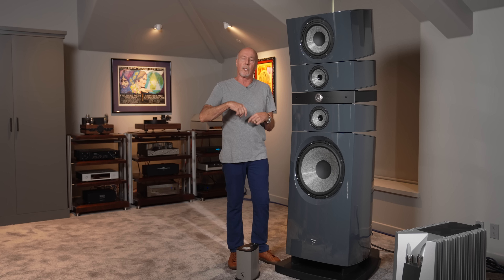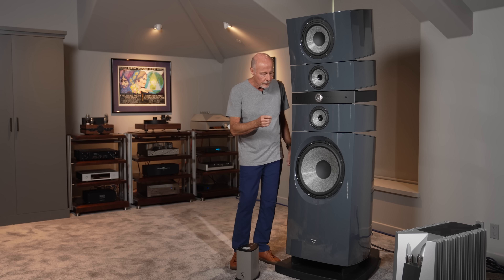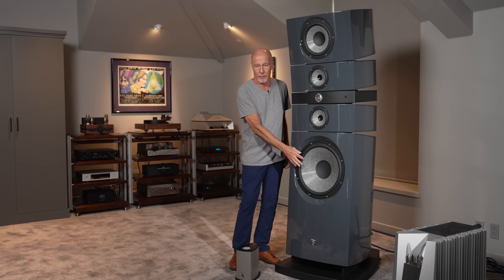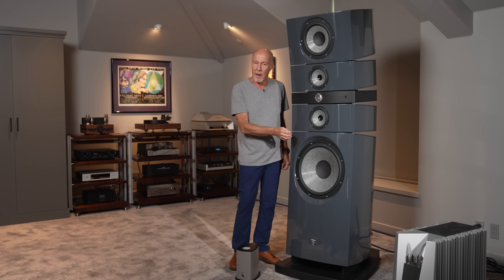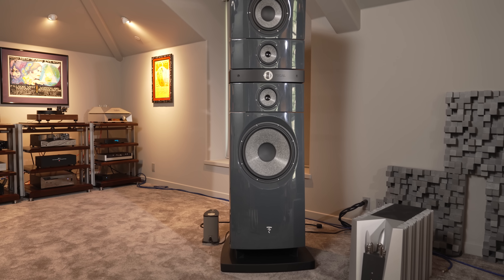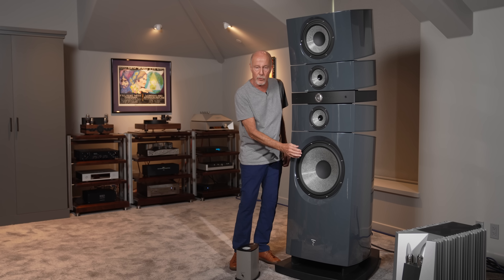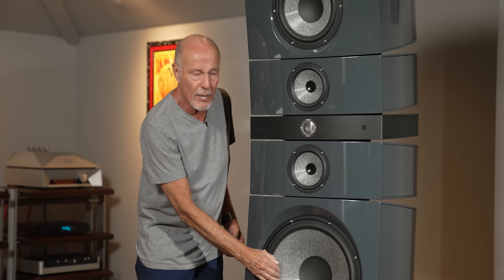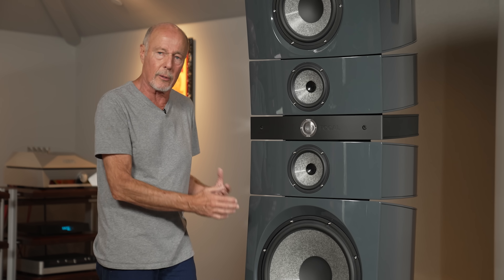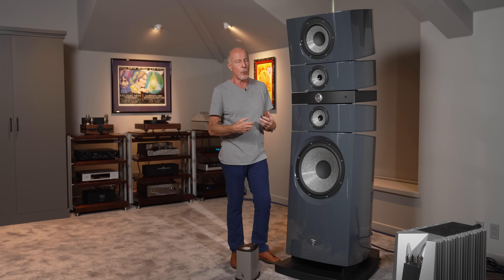People talk about the size of voice coils — this got a two-inch voice coil, this got a three-inch voice coil. Let me break something down to you. The voice coil on this speaker is over 15 pounds of copper. Over 15 pounds. And that is what's required to get the bass driver to go deep enough. To go deep, you're going to have to use a stiffer, possibly more dense cone. You might have to use a suspension and a spider, make the suspension a little looser, the spider a little more compliant. But in order to get it to reproduce bottom end and not break up and not distort, there's a lot that goes into that, and that's what they did here.